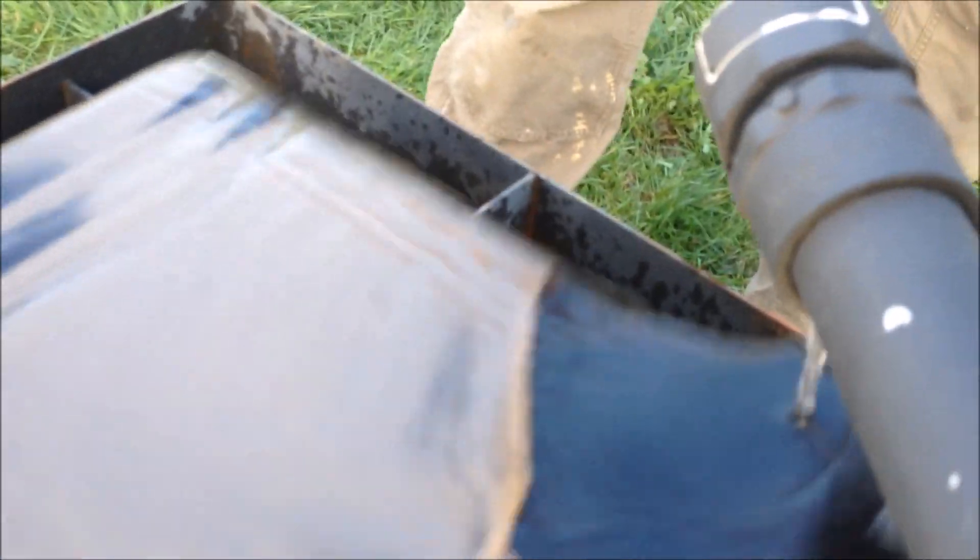It's pretty much all through here. We're brushing this down — this is all going to go right into the high-grade concentrate hole, the number one hole we call it. It continues to move down the table and clean at the same time, and we've got virtually all the fine gold going down into our number one concentrate hole.